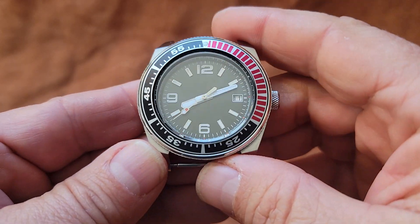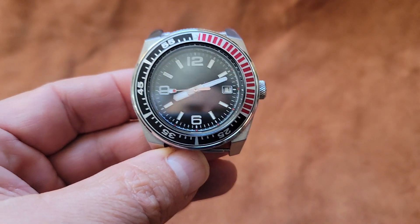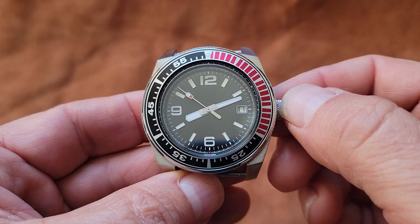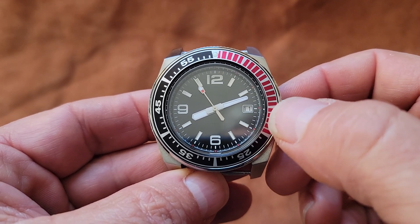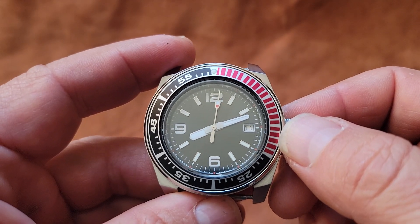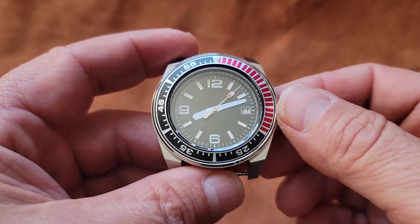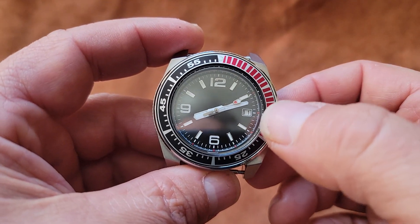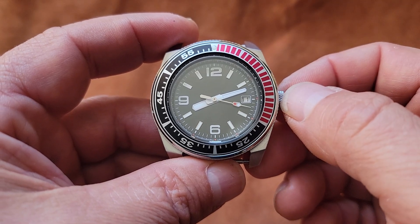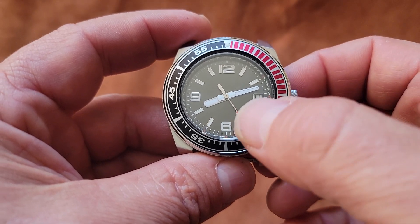These are some watches I picked up and I'm putting them on custom bands that I'm making, but that's it — just how to set your dive watch. All dive watches will be similar. If they don't have a date complication, when you pull out you might still hear a first click, which just means they put in a movement that was a little less expensive that has a date complication. For Seiko, I believe it's the NH38 that does not have a date complication, but it costs more money so they don't put them in. If you have a day-date complication — meaning you see the day of the week as well as the date — when you pull out to that first stop, turning it one way will adjust the date, and turning it the other way in the same position will change the day.